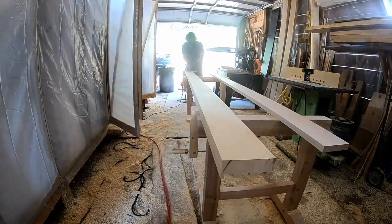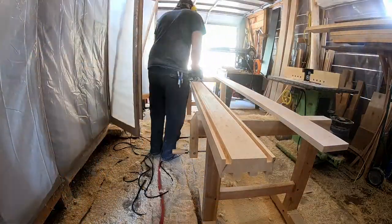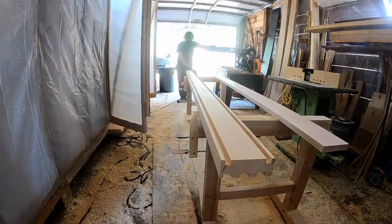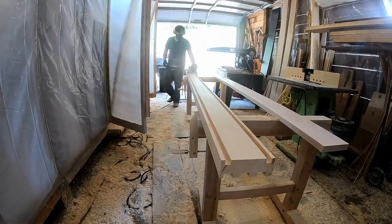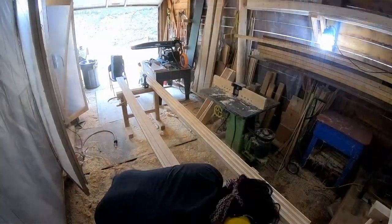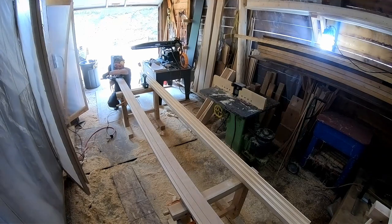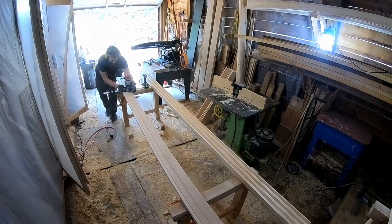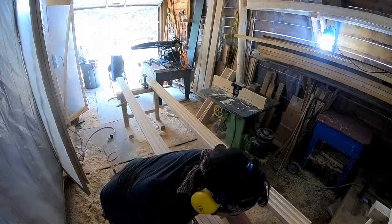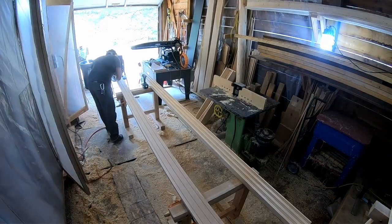So I flip the header over and I'm going to do two more grooves that are the thickness of drywall, so that when they install this in the rough opening, they can slide the drywall down into these grooves and it'll be a super clean finish. For the shiki, again, it's a maple board with these thinner grooves. Up close there, more little troughs with chamfered edges, and that lets those wheels sit down into them. This again, it's not going to show up as much on their finished floor as a deeper